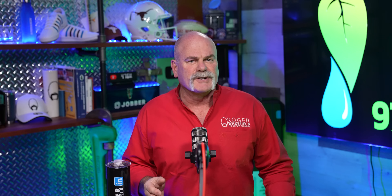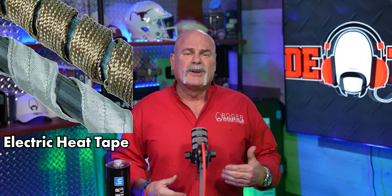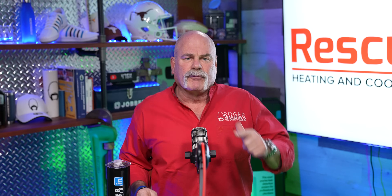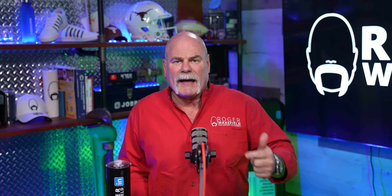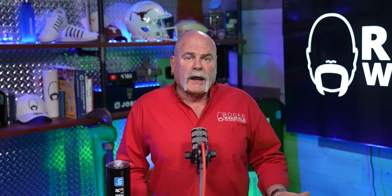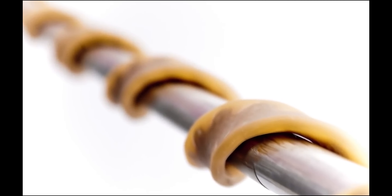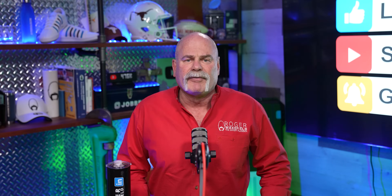If you've tried all these things and you're still afraid you may have problems, there's another thing you can use: electric heat tape. You can buy this at most big box stores or order it online. If your angle stops on an exterior wall stick out far enough, you can wrap heat tape around them and plug it in — it'll heat the water inside and move it back through the pipe to keep it warm enough in the wall. If you've got a hose bib on an exterior wall, you can do the same thing. I once made a repair where we opened up the wall, wrapped it with heat tape, stuck the plug out, and closed the wall back up — she could plug that in any winter to keep from having problems.